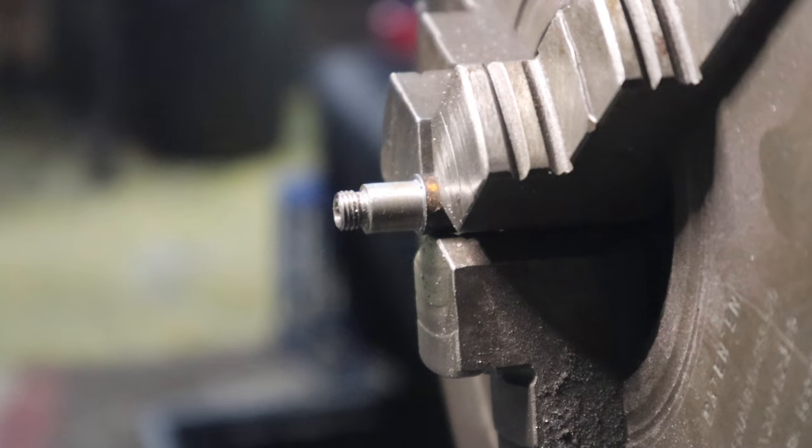I don't have my collet chuck for this fully functioning yet — I have an MT5 collet chuck but I haven't got the drawbar yet. I've got some threaded rod coming in the mail to make that drawbar. Normally what I would do is cut that off, flip it around, use a collet to hold the threaded end, and then do the other side, but because I don't have that functioning I can't hold the collet chuck into the spindle without the drawbar. So what I'm going to do is use a left-hand turning tool — cut a little groove with a parting blade, turn from left to right the other direction to make our major diameter on our hex end, and cut in that little shoulder.